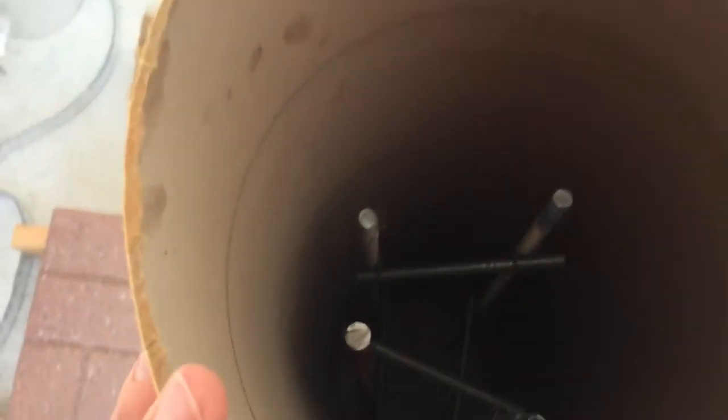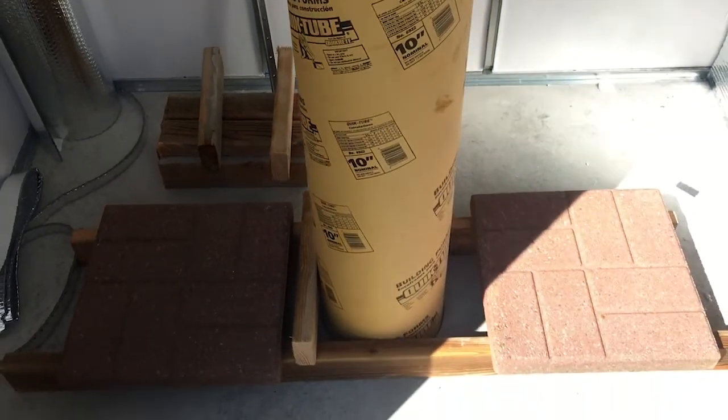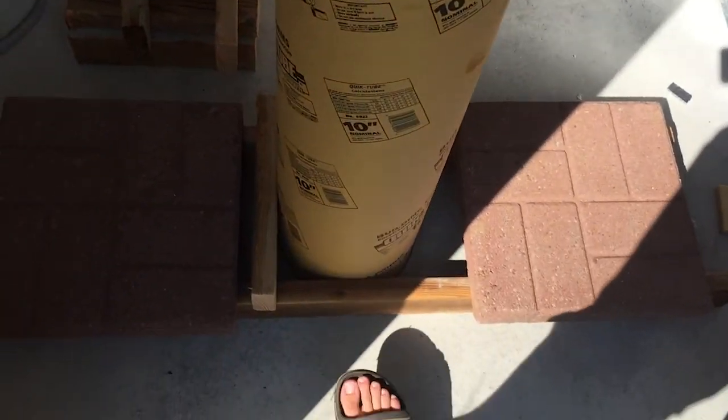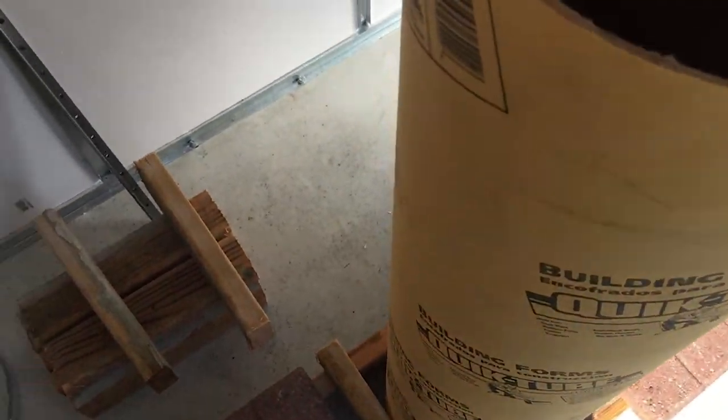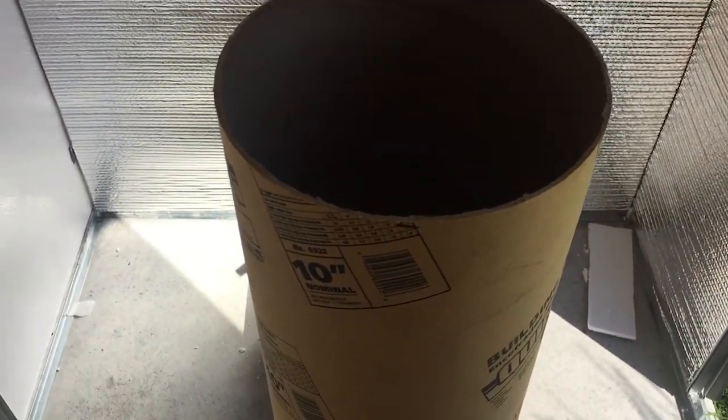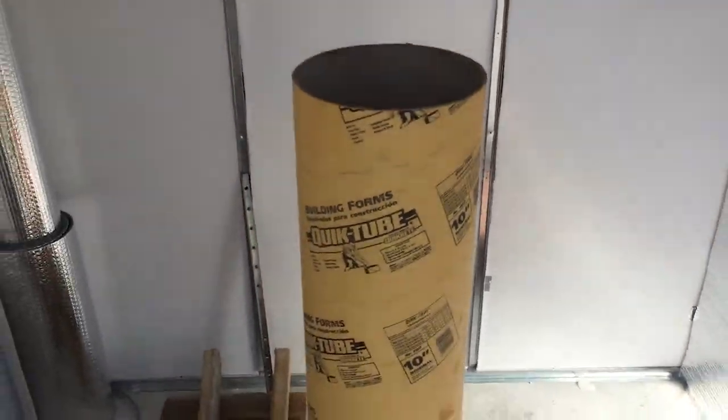So here's the tube in the correct spot, got the rebar there, and that's where the pier is going to go. It's a much better solution than a tripod, with much more room to walk around. I did off-center it by 2 inches back that way for proper spacing with the walls, with my RC6. If I need to, I can always drill different mounting holes on the steel plate for proper centering for different telescopes. So that's where the pier is going to be.